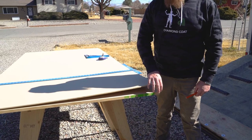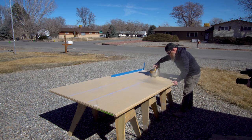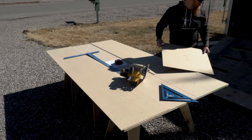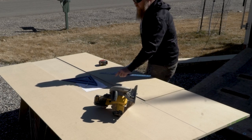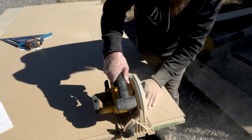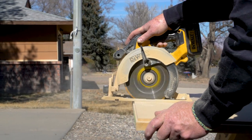I'm only cutting quarter-inch MDF for the backsplash, but I always leave a blank sheet of MDF down as a work surface. I'll set my saw blade to just slightly over a quarter-inch depth — you'll have little scores in the bottom sheet, but you can really slide pieces around. I'm cutting full-length strips, 18 inches tall. Many aspects of construction people are very intimidated by, but it's really just intricate measurements. Women often have more natural attention to detail — don't be intimidated. When you're bidding a job at $55 to $85 a square foot and you can add thin, easy material like this, your price just goes up and you make a lot more money very quickly.